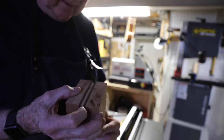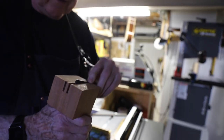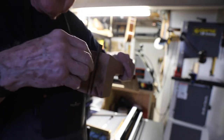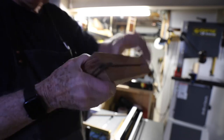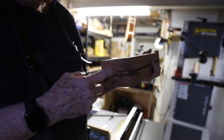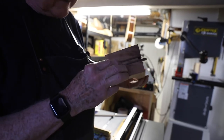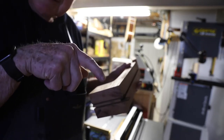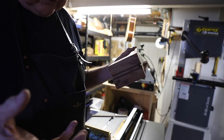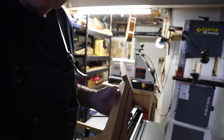This is rosewood, and what that will do is prevent the mahogany - which is softer than the rosewood - from that insert ever pulling out and separating the neck, because some players like to bend the neck and do all that kind of thing, which puts all kinds of pressure in here. With this glued in place and screwed against the hardwood because it's threaded, it makes for a better join and helps the body transfer the vibrations from the neck into the body of the instrument.